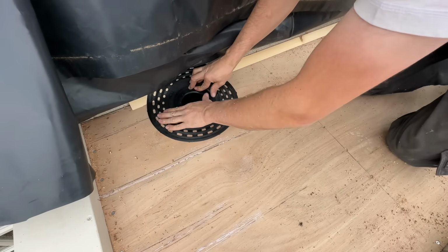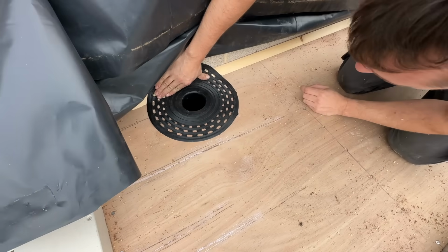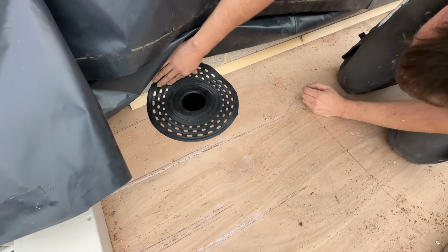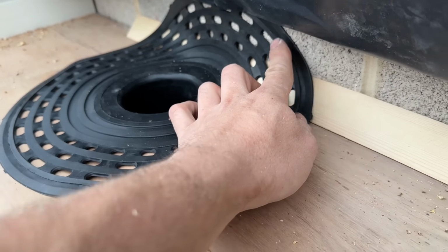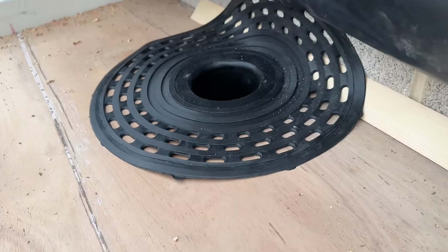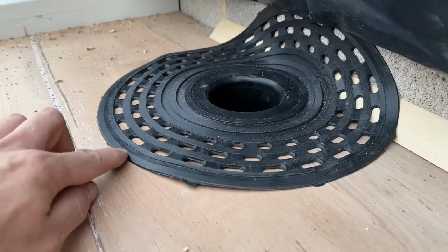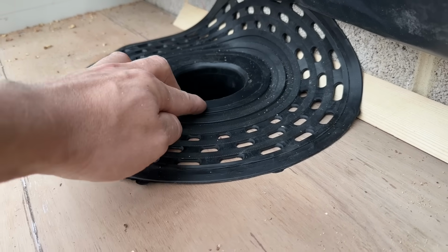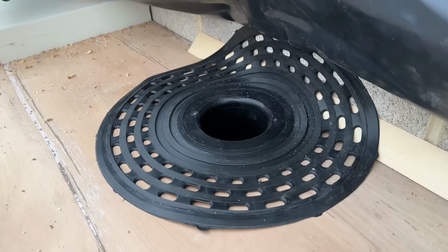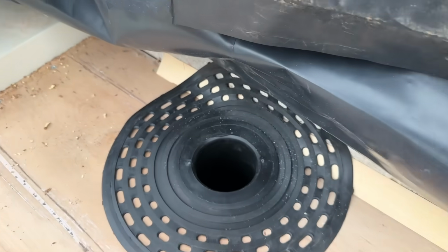I think that's about the right size. Just 1 inch, 30mm little curb. Screw that down. He's explained to me the first layer of his felt, it's a 3-layer felt system. The first layer goes up to this circle, creates the same height as this, and the second layer goes over, bonds to it, and I think again, there's a subsequent 3rd layer, so it should be well sealed.